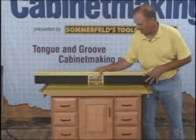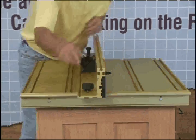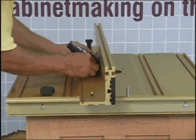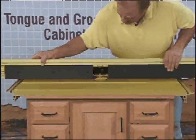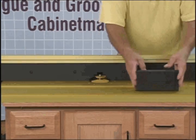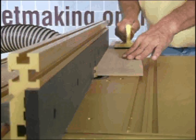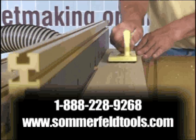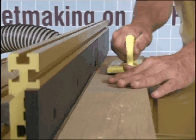It comes with a huge 4 3/4 inch high fence that adjusts in and out fast by pivoting on a retractable spring-loaded pin, then locks on the opposite end with a threaded knob. You also get a 4-step dust port to fit virtually any sized hose, sub-fences that slide left and right for maximum workpiece support, 3 zero-clearance fence inserts that you can cut to match the profiles of the bits you use most often, and 3 interchangeable locking center insert rings. It's a complete, well-designed package that's large enough for your biggest tasks, easy to use, versatile, and as rugged as they come. But enough of that. Let's see more about how you'll build this router table cabinet.